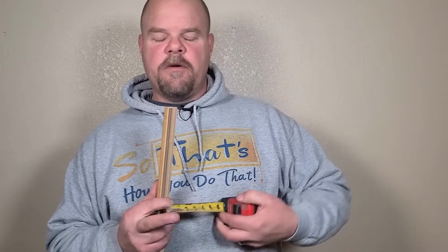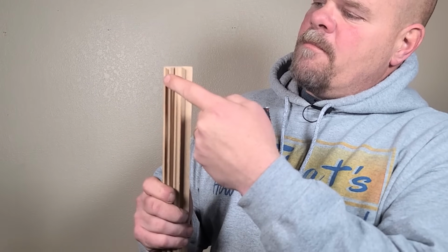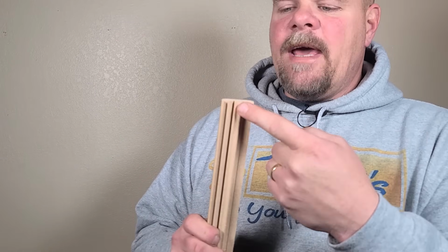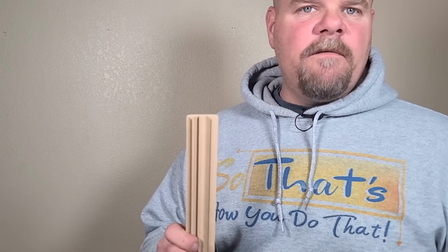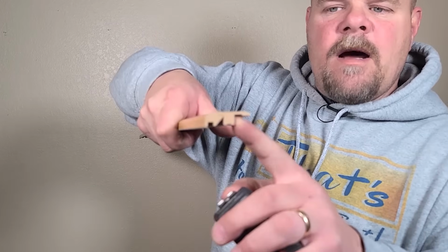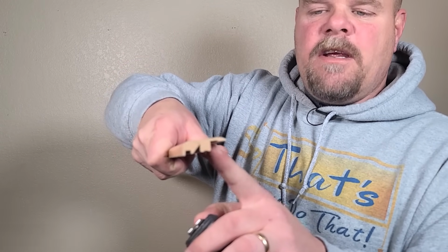Now basically when you're figuring out how far you need to cut your plank away, you're just really trying to leave a gap that equals what this leg is and this other part that supports underneath on top of the concrete, okay? And then a little bit past, like 1/8 to 1/4 of an inch. Now this lip right here that comes past is about 1/2 inch, so you have a lot of play for your plank to be in here, okay?